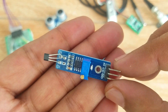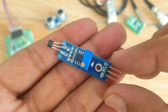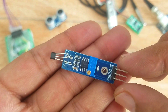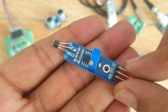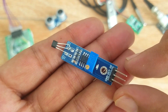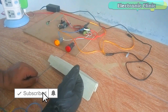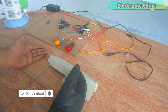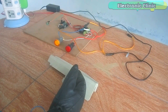This is the magnetic Hall effect sensor, which can be used in projects where you need to detect the presence of a permanent magnet or electromagnet. It can be used in speed measurement and contactless control systems. This sensor is usually used in locations where you don't need to make any surface contact. I have uploaded a video in which you will learn how to make an electronic glove based on the magnetic Hall effect sensor, Arduino, and 433 MHz radio frequency modules to protect workers from coming into contact with moving machine parts.